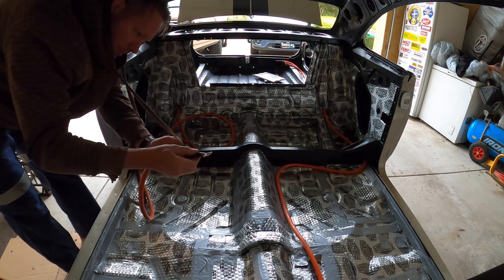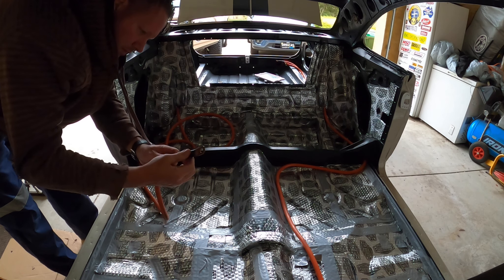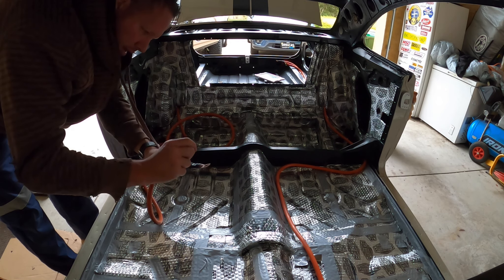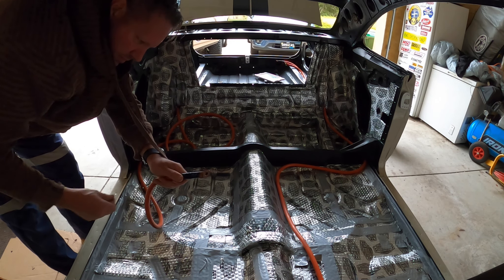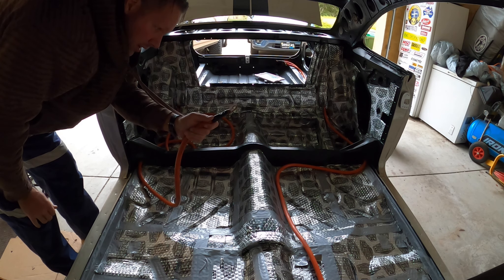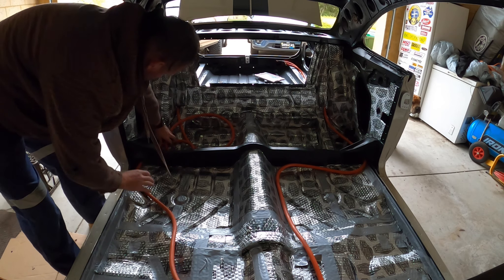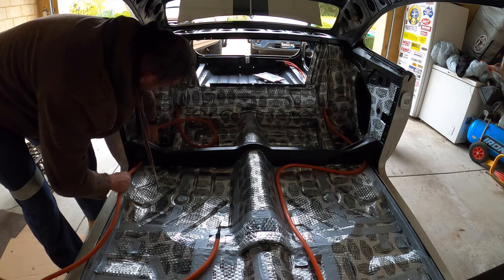If you're going to do it at home like I did, I just got two bolt heads and put them - one there and one there - and then just crimped them in the vice. So there's no way in the world that's going to come undone. It's a really good connection, and just an easy way of doing it if you don't have the crimping tool.